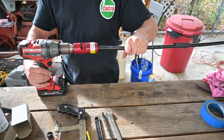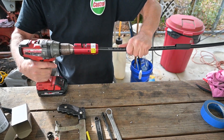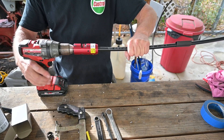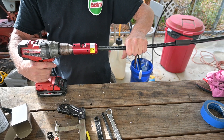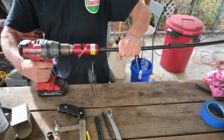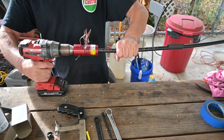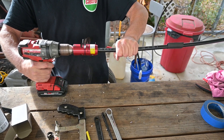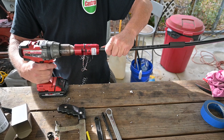We're going to start by feeding the cable into the cable prep tool here. What you want to do is feed the cable in until the copper stops shooting out. Make sure you wear eye protection when you do this and you're holding it square to the tool. When the copper stops, your cable is done. Hit reverse and back it out.